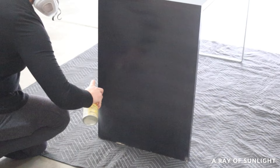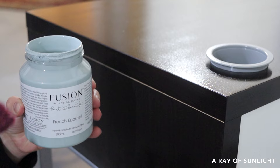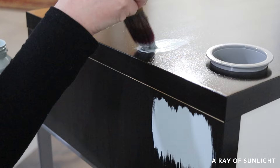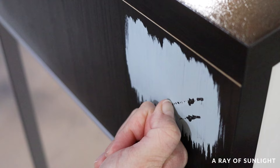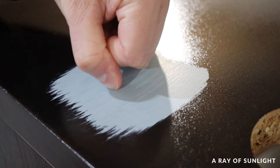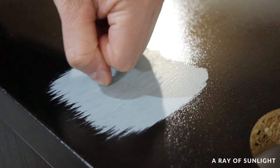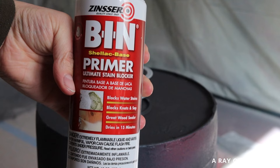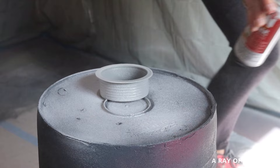I didn't spray one side of the desk so I could do a little scratch test. A few hours after spraying the shellac, I brushed some paint onto the side without shellac, and on the shellacked top about 12 hours later I scratched at the paint. The paint scratches off easily without the shellac, but stays on great with shellac underneath. I will say the clear shellac doesn't work as well as the white-tinted BIN shellac — the paint and clear shellac scratched right off a little plastic ring, so I ended up spraying that with BIN shellac primer. I'd very much recommend just using the BIN shellac primer.